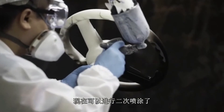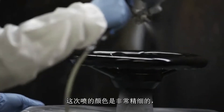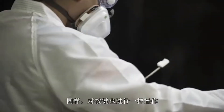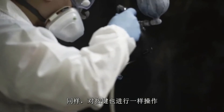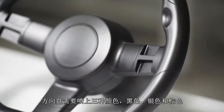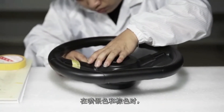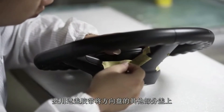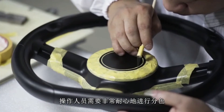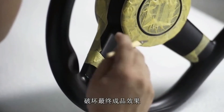Now the next coat can be applied. This is still not the final top coat — it serves as a base for the further colors that need to be added. The spray paint used is incredibly fine and great care is taken not to produce any bubbles or unevenness. The buttons are also given this same coat to prepare them for the next round of painting. Once this coat is complete, it's time for the final colors to be applied. This wheel uses three different colors: black, silver and brown. When the silver and brown are being applied, the other sections of the wheel need to be covered in masking tape. This is a fiddly task that requires great patience and precision. A millimeter or two off and paint will be applied to areas where it shouldn't, spoiling the overall finish.